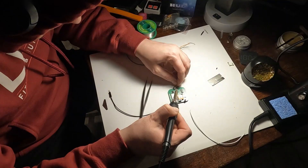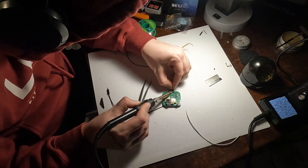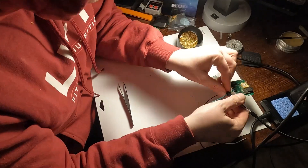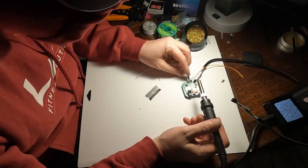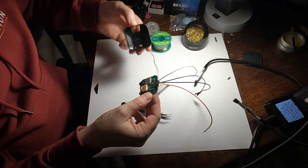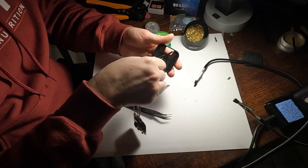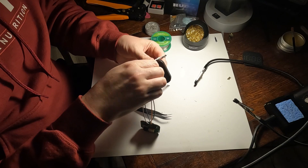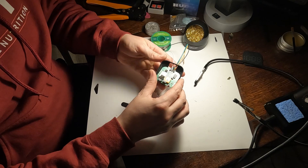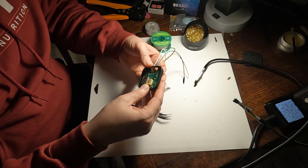I've got the wire stripped back a little bit and I'm just putting everything in using a soldering iron. My recommendation here would be to not go too crazy with how much wire insulation you strip back, because if you have too much exposed wire, you're going to end up with the possibility of accidentally grounding out wires that you don't want to ground until you push the button. At this point, you've got all your wires connected. What you're going to want to do is basically feed the wires through with the charge port facing down on the GPS unit, just the way that it came out.